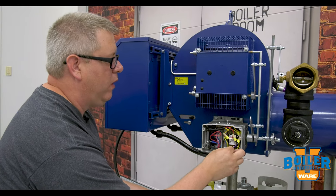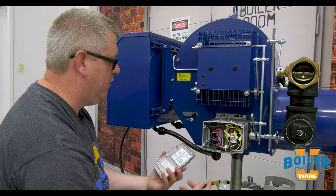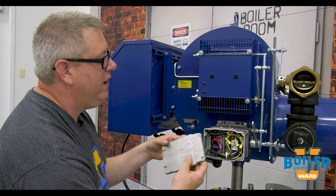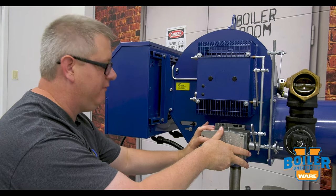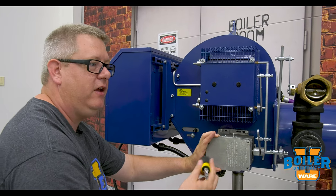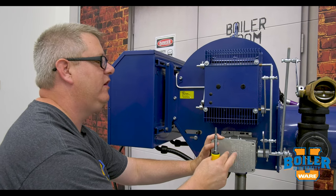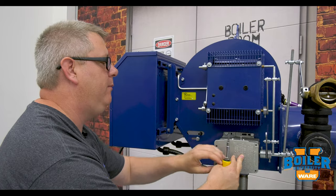Now that we've got this group of wires anchored together, it's not going to get caught in that rail there. The one way to verify that is when we put that cover on, if you just take your screwdriver and tap that, you're going to hear that metal-on-metal tone, which is going to tell you that you don't have a wire pinched in there.